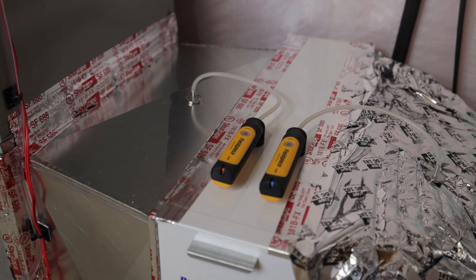I've got everything installed and it's looking pretty good. Doing a pressure drop across the filters — I'm kind of curious what these 5-inch filters are doing. The book says they're supposed to be a 0.12 pressure drop, and right now I'm seeing about 0.08 to 0.09, so that's phenomenal. This is a 5-inch MERV 11 filter on a 4-ton system. Since we had dual returns, I wanted to put two filters on it to minimize the filter pressure drop across the whole entire system. I'm really pleased with how this has turned out. Really appreciate you guys coming along — hit that thumbs up, subscribe to the channel if you haven't already. Till next time, see you guys later.